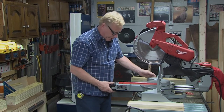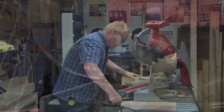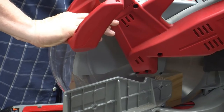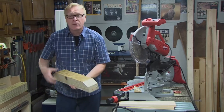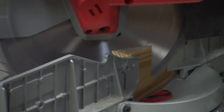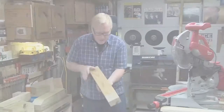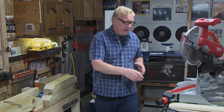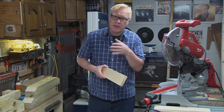I'm going to turn the saw to sixty degrees and cut the bevel on the ends. That looks great. While I have the saw set up, I'll take my pine pieces — the pads I'm going to attach underneath — and cut them to four and a half inches. After that, we're going to cut our dados.